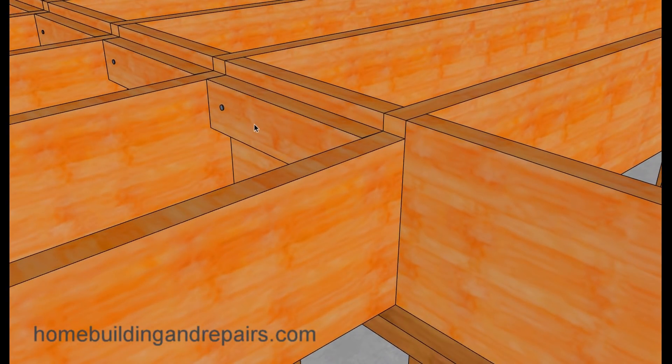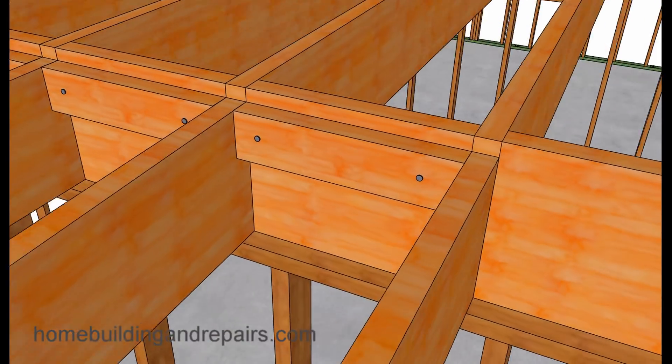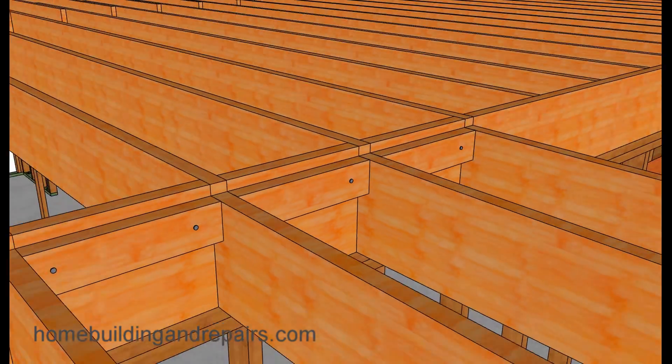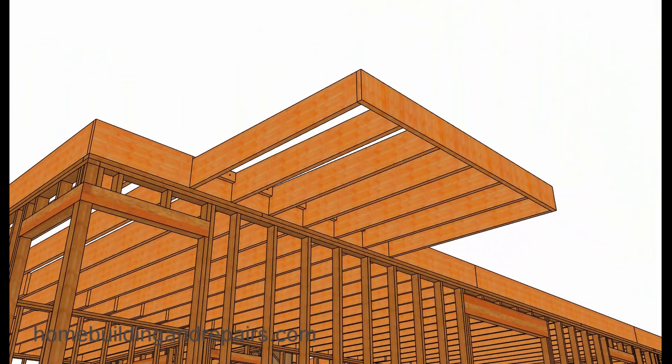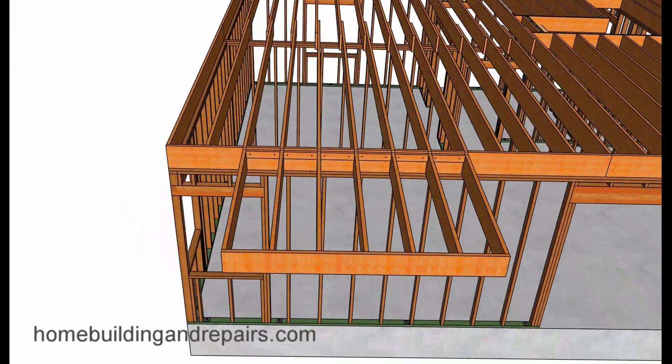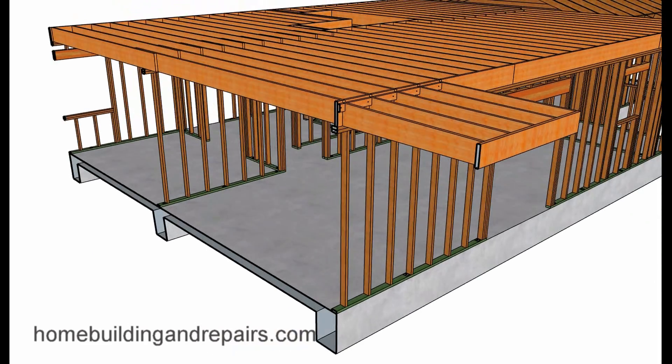Here's the one-inch drop I'm talking about. You will need to nail some blocks — whether they are two-by-fours, two-by-sixes, or larger — to help give you a perimeter nailing surface for the plywood that you will be using for the deck. Don't forget that the deck plywood might need to be an exterior-grade or special plywood, not the same material used inside the house.